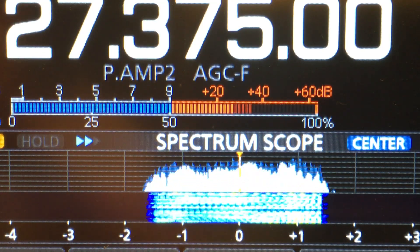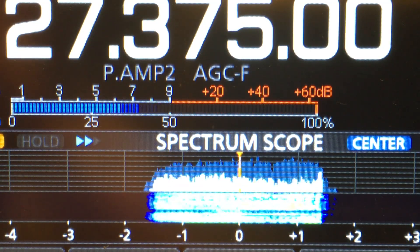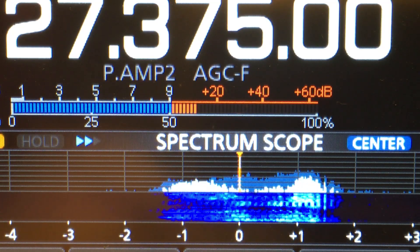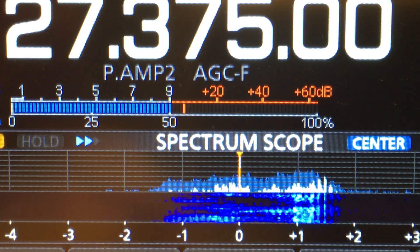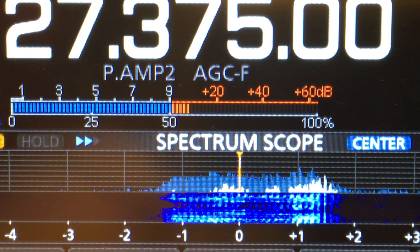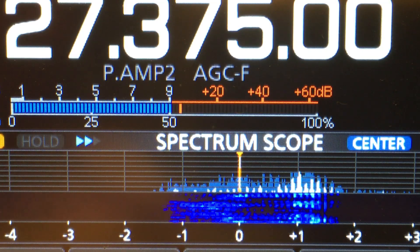I'm surprised - I thought you had a bigger antenna, but you kind of do, it's just they're stacked. Are you a half wavelength apart on the stack? Just over half wavelength. You can get about 3 dB gain at half a wavelength, so you get a little bit more dB gain, but if you go too high it basically becomes a 180-degree antenna.